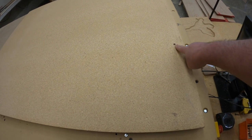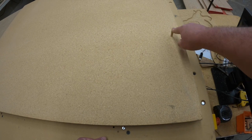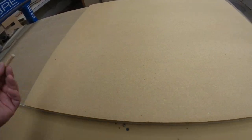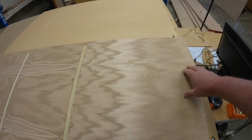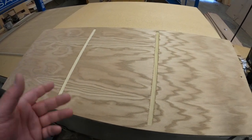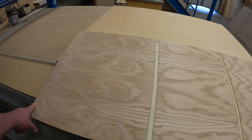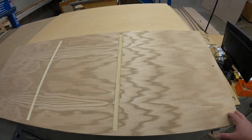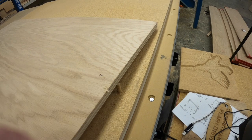I took the compressed air and blew out the holes. Now I'm going to take a dowel pin and push it down in there — that's what we'll use to index our piece so it's in the correct spot as we flip it. I'll do the same on the other hole. Now I'm getting the board we originally cut. The pin in the table is going to go into this hole. I want to make sure it's oriented the same way — top side still on top, bottom side on the bottom — then I'll flip it over and carefully guide the pin into that hole.